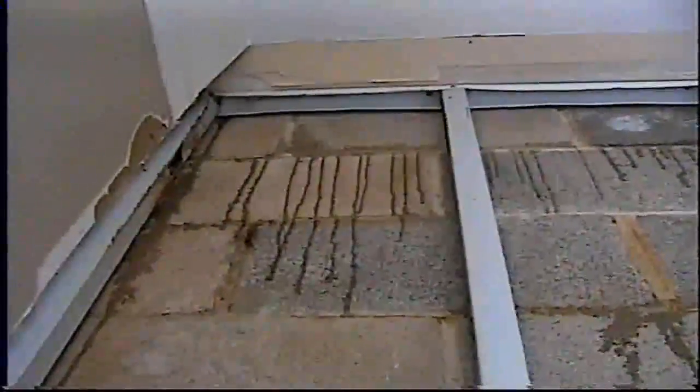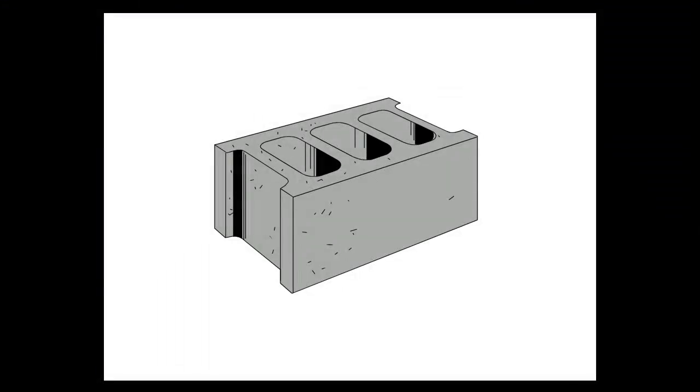And that trademark look where everything is emanating off of a mortar joint. We have big areas on that course — go down a couple of courses, there's another one which oddly skips a space and then is really prevalent in the next three spaces. The blocks have many holes inside them — they've got cores. Back behind here is an empty space, and behind here is an empty space — a hole running vertically through the block. So there are internal passageways for the water. This is just what managed to break the interior surface so that we can see it.